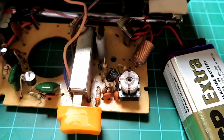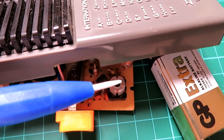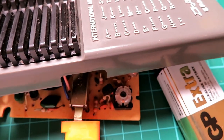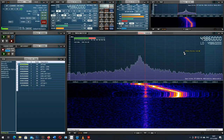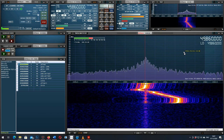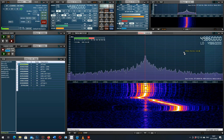There was no evidence of any tampering on the inductor. If you're ever going to adjust these inductors, always use a ceramic tool — it's much safer. I tuned these down as they had drifted quite a way up the band. I tuned them back on frequency straight off the SDR, and they were about a megahertz out.